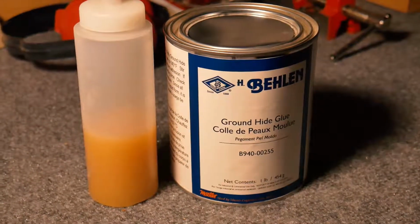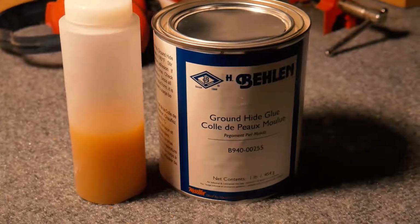the traditional glue. I mean, this is the glue that was around before all these other ones, and it is an amazing material. It's made from the protein colloid of animal connective tissue, like collagen is essentially what it is. And when you buy it, it's in this granule form. It's like a solid grain that's a little coarser than sand. And you take a specific ratio of this grain to water, and then you mix that together, you heat it up, and when it gets to a certain temperature, it liquefies and it turns into a fairly thin glue that then can be brushed or squeezed onto glue joints.